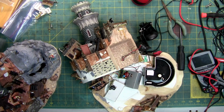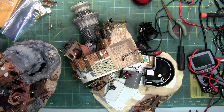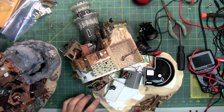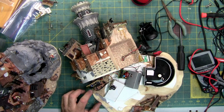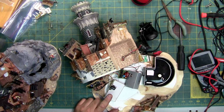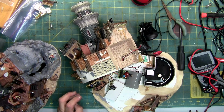Now, because this is a different model, probably a Gen 2, the only thing that's the same on this is half of this circuit board. The transistors for the lights and the sound, that's it. So even thinking, oh, I could swap this board for that board and see if I can get this one to function, it doesn't have the rest of the components to send everything over here and control it, which means it could have a backfeeding issue and then fry the other board.